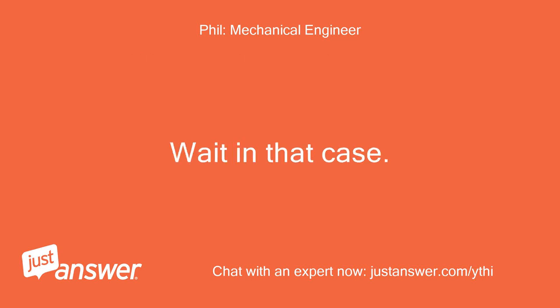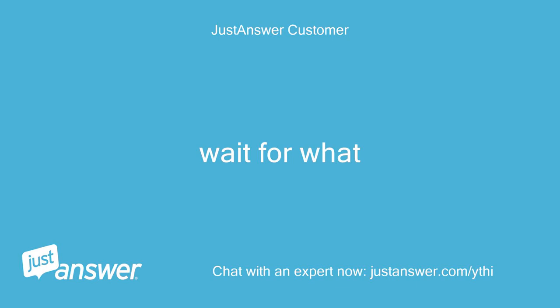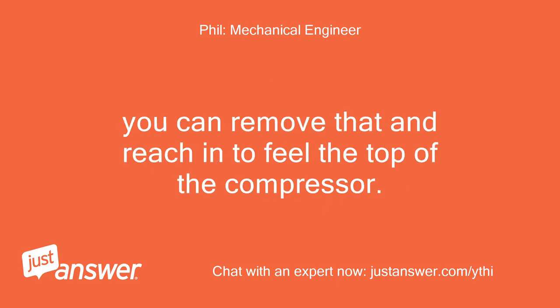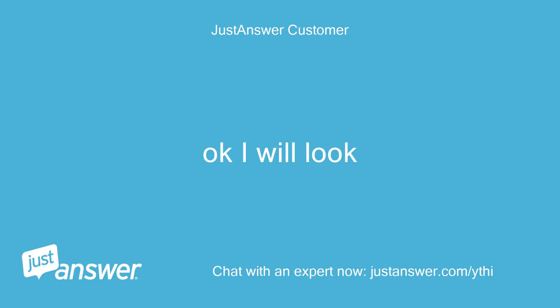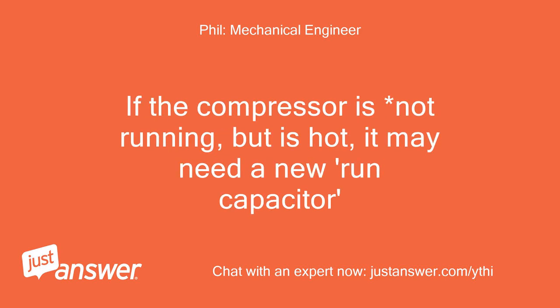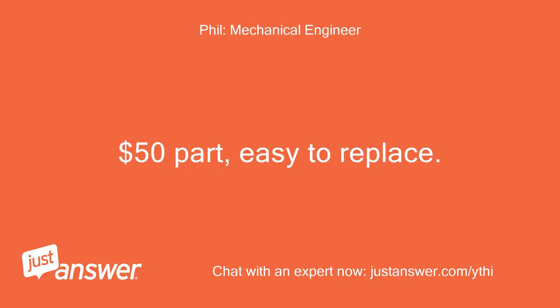Wait, in that case. Wait for what? There should be a small panel near where the electrical and refrigerant lines attach to the unit. You can remove that and reach in to feel the top of the compressor. Okay, I will look. There are no time limits here, you can take your time. If the compressor is not running but is hot, it may need a new run capacitor. $50 part, easy to replace.